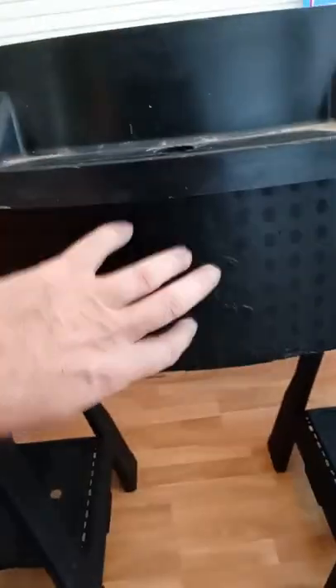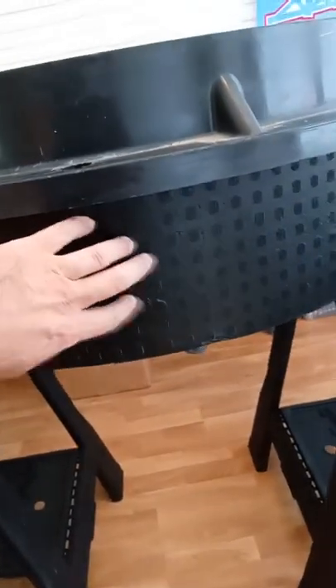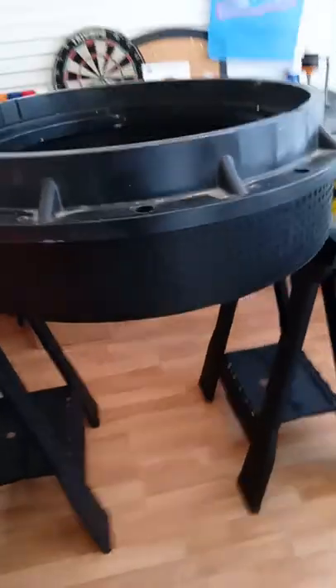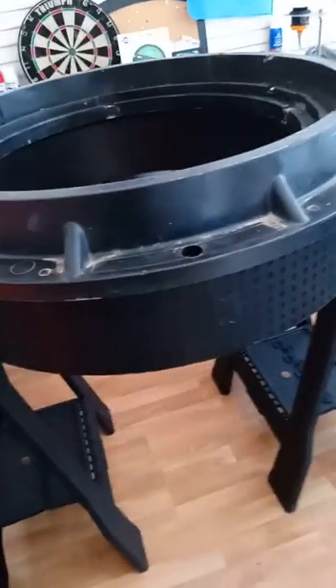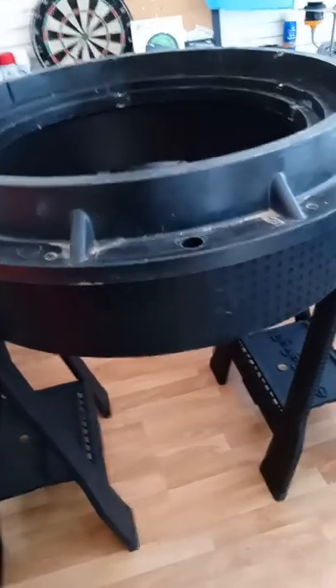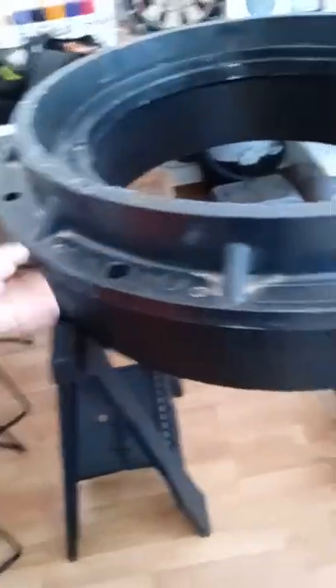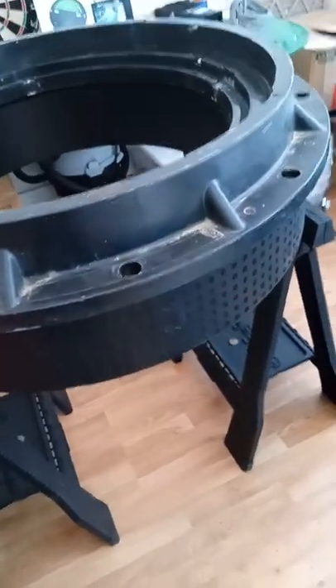Here's an elevated look at our ring. This is a six-inch adjustment ring provided by Cretex — it's called a Pro Ring. It's the very best solid core ring I've ever seen in my life, better than any other product I've seen on the market. It's lightweight but does its job because all of this is going to be encased in a concrete apron to anchor it down.